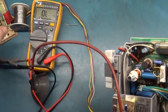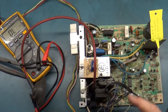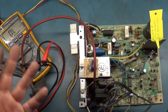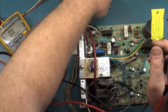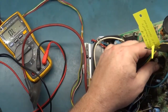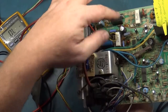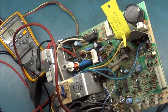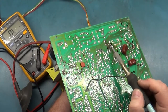Now we have that set. What I'm going to do is try turning it on to see what it does, because if it still goes into shutdown, I know it's not our power resistors or power components. We didn't test the fuse — 0.3 ohms, fuse is good. I always like to take these out, clean the edges a bit, and snap it back in. Someone's changed these two caps, this cap, this cap, and this one — the rest are factory. I don't know why they picked and chose, but let's get this cap out of here.